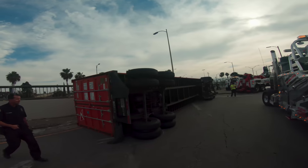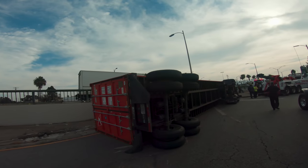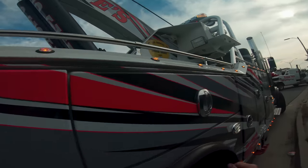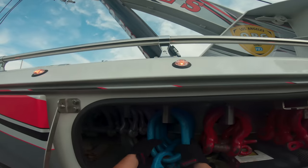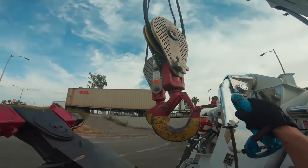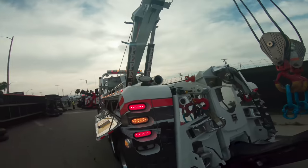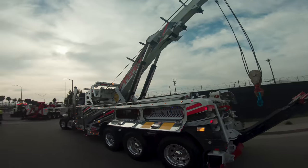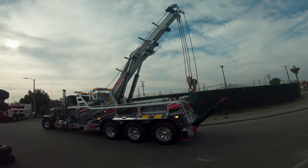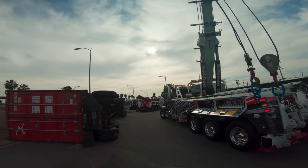Let me see if I parked as strategically as I planned. I put my shackles already on here, and I'll leave my cables on free spool. But before I put my outriggers out, I'm going to do something to test if my truck is in a good position — I'll put my truck 90 degrees to the side.